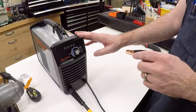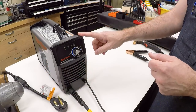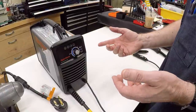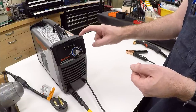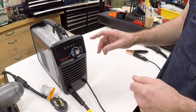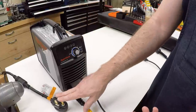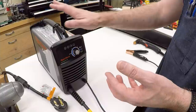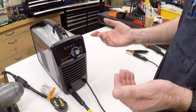Let's talk about the risks. First, this is a high-voltage power supply. The input is 240 volts AC, which gets rectified to DC — multiply that by 1.4 and you're talking north of 300 volts DC, with enough power to deliver 30 amps. That is totally sufficient to kill you. Additionally, that voltage will most certainly be stored in filter capacitors, which means even after you unplug it, that energy could still be present. So after I open it, I'm going to check all high-voltage connections with a multimeter first to make sure those capacitors have drained.